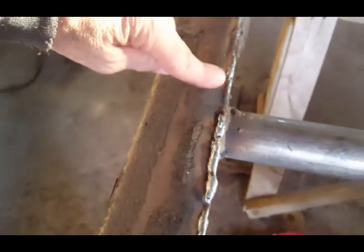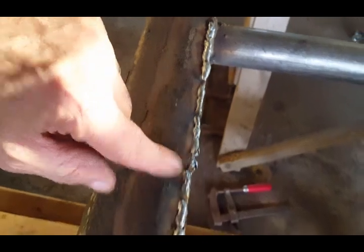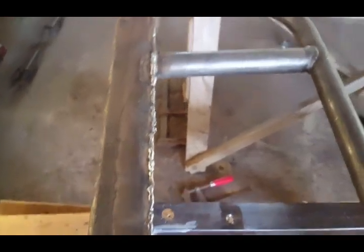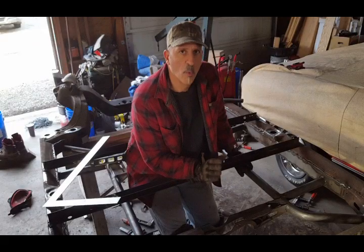I welded like every 2 inches, stop, started again, stop, started, stopped. See that? You want to maintain that. You don't want to keep welding because you will tweak the frame. I'm all done welding